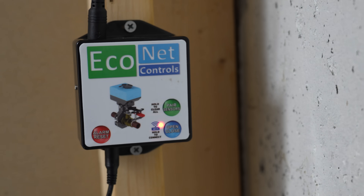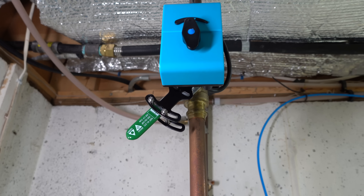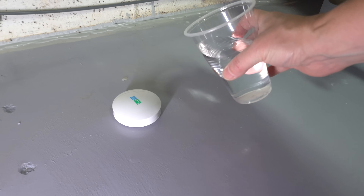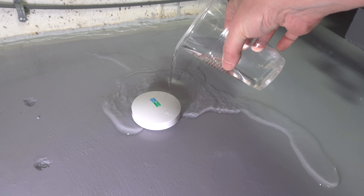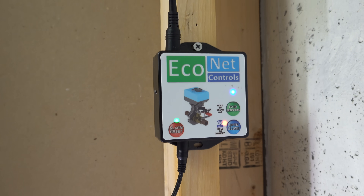At this point, your installation is complete. It's pretty amazing that this can be done in so little time, but you'll want to test it out. You can push the open/close button on the control unit and the valve will open and close the same way as if you were turning that handle on your own — except now, because it's under computer control, you can run it with one of these sensors. Here I'm simulating a water leak in my basement and within just a couple of seconds, you can hear a relay click and it automatically tells that valve to shut off the flow of water.